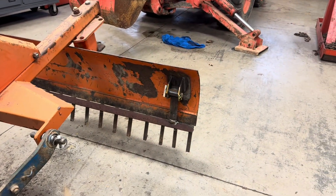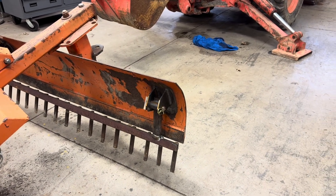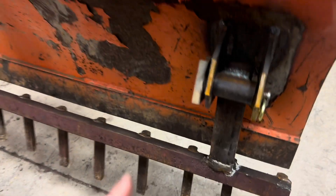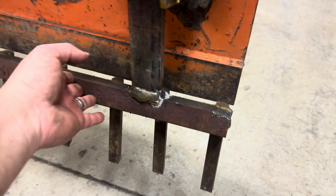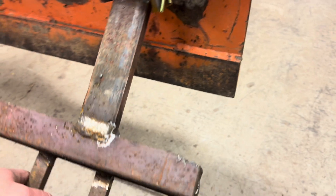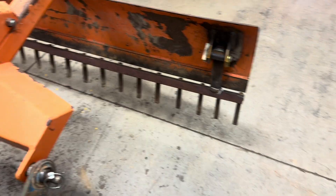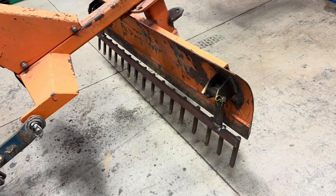We also built this ripper. It's going to be used for Little League Baseball. They originally wanted me to weld teeth onto the blade, and I didn't want to do that. So we made these brackets to where it'll hinge, and it sort of works like a root rake on a dozer — when it's pulling forward, it pushes back against the blade to rip with. And if they want to back blade, they can set it down and it'll fold forward to back blade the smooth ground, or they can unpin it and take it off.